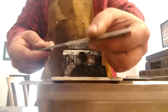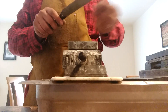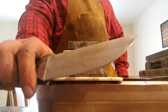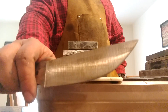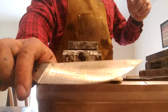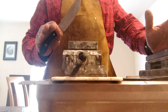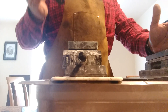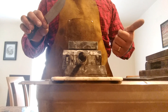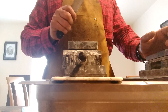This is too thick for me to enjoy behind the edge. We want that bevel to look like a micro bevel. This is probably on the safe side of knives — if I wanted to clean this up and ship it out, a lot of people would be satisfied because it would be really, really durable. But we're not looking to make the ultimate durability in knives. We're looking to make knives that cut really, really good — more delicate, but they'll sharpen better, cut better. You're not going to get a lot of companies that will do that because they don't want to deal with warranty issues, it costs more money, and it's difficult to get a knife very, very thin without burning it. So it's easy to make thick knives, but we want to make them much, much thinner.